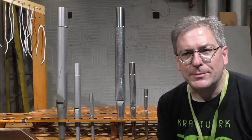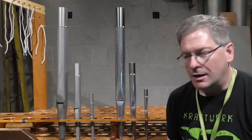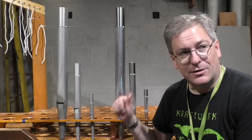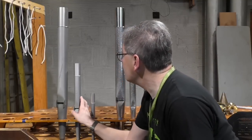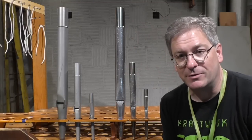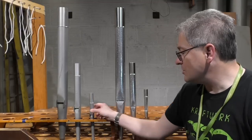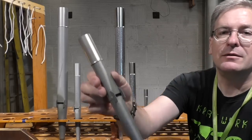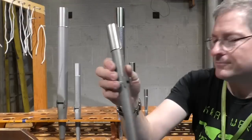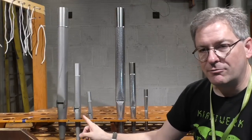So here's what's going to happen. These pipes, 1, 2, 3, are out of the unenclosed choir division on the other side of the hall. I'm in the voicing room here. Voice number 166, 8-foot principal from the unenclosed choir division on 3 3/4 inches of wind, and with double languids. See the extra seam there? So these 3 pipes have double languids.